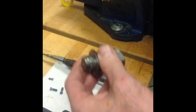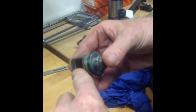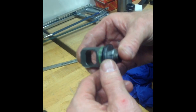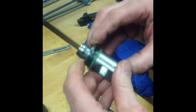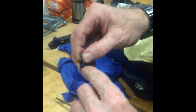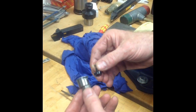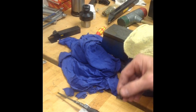With the drawbar assembly, what we're looking for are a few key wear points. Inside this square window at the back, we're looking to see if there's any big wear area or any concave area from where the camshaft makes contact. This one looks in really good condition. We're also checking this area for any cracks. The spring has to be able to function up and down properly and the segments need to be able to move freely. This one looks in really good condition. Also on the retainer, just in front of the step that meshes with the camshaft, we want to make sure there's no wear on the front edge of that retainer, because that's what's keeping the camshaft from moving any farther than 180 degrees. If there is wear there, that's an indication that somebody's been using excessive force for clamping.